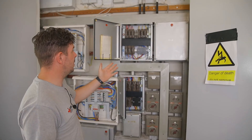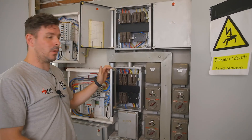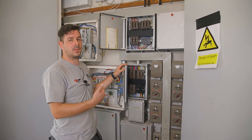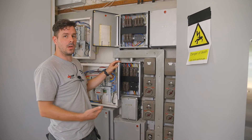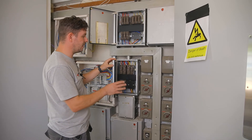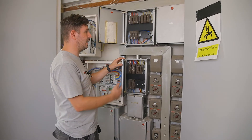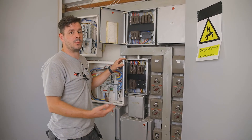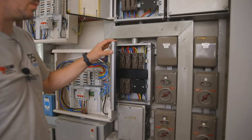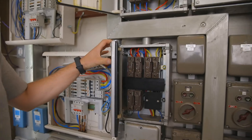Some of this installation can be up to 80 years old. We need to find out from the client whether this equipment is still in operation or now obsolete. We're constantly liaising with the client to gather information and do the best job we can. If equipment is obsolete, the right thing to do is properly decommission it — disconnect it and make sure it's not being used — rather than just leave it there non-operational. Some of the switch gear is so old it simply isn't operating correctly, so we may need to properly assess all of that.